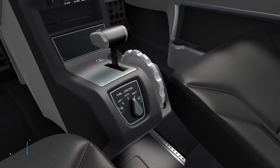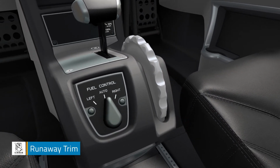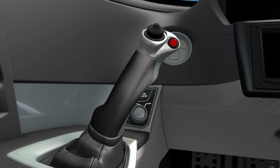And though a problem with the system is highly unlikely, it's worth discussing the causes and the remedies of possible trim system malfunctions. First, runaway trim occurs when the system has an uncommanded and rapid change in the trim condition. This can occur for both roll trim and pitch trim. Reaction to the two varies slightly.